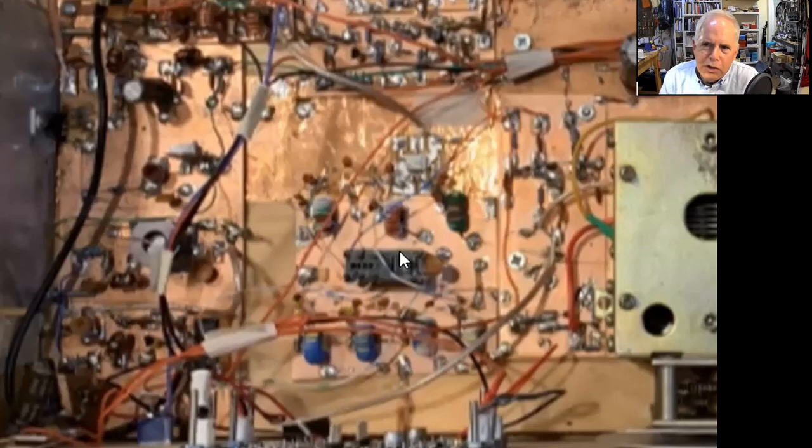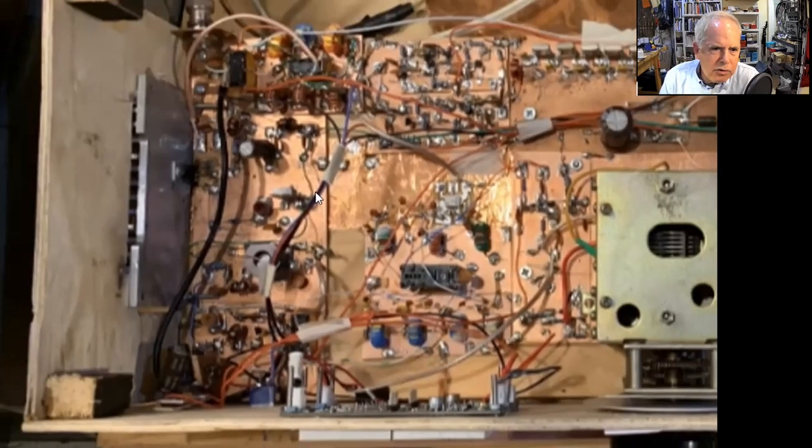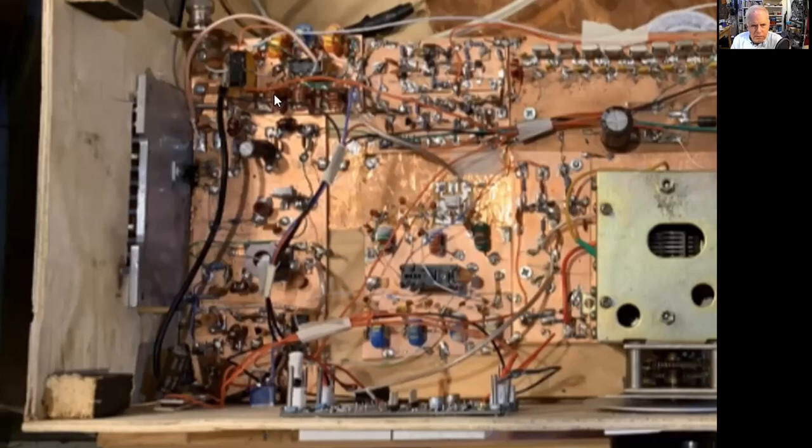There's a potential for bleed over, but I tested it. It worked okay. And then down here, this whole side I left kind of reserved for RF amplifiers. So you have the first stage of RF amplification. Here you have the driver. And then it goes, here's the IRF510 on a nice big heat sink that I actually cut a hole for and put on the outside of the box. Here's a switchable low-pass filters, one for 75, one for 20.